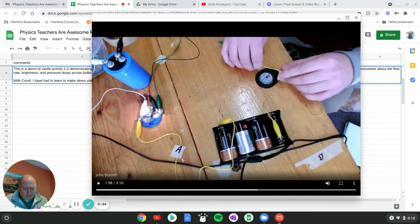So when I close the switch, we know that eventually the capacitor is going to be charged. So I like to jump to the end result. If the capacitor is charged, it'll treat like an open circuit. So then I would have expected in the long run both light bulbs to light up. Now at the very beginning, in the transient part, there would be an opportunity for the current to flow rapidly through the capacitor and flash that other light bulb, but I would expect that other light bulb to stay lit, so I'm trying to understand why it wouldn't. The capacitor gets charged. Does it drive the current to zero?